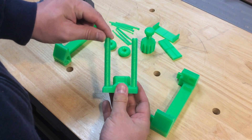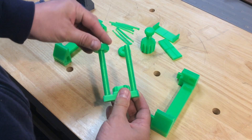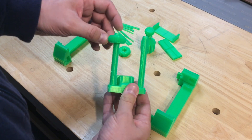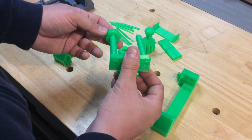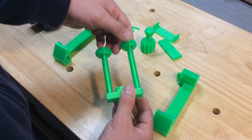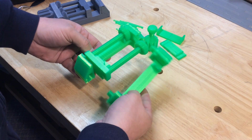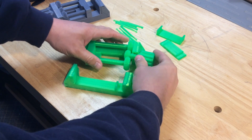The real test: how well do these gears fit on the threaded rod? They seem pretty smooth. There's a little dot on the piece that you line up so you know its position — that's supposed to face down on the inside. The 104% sizing worked nicely; it fit over the gears snugly but spins really well. With the gray one I had to work the gears up and down a few times even at 104%, because those threads were printed at 0.3. These are at 0.15 so they're coming out much smoother.